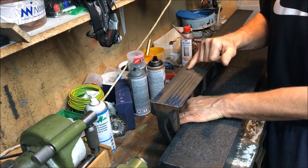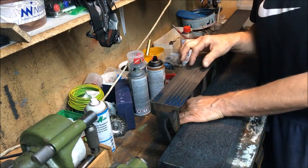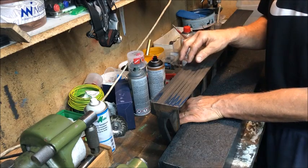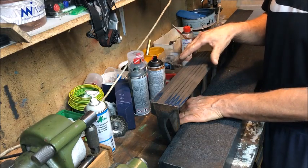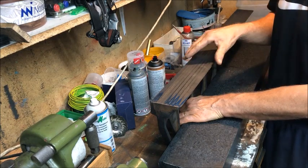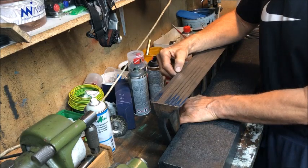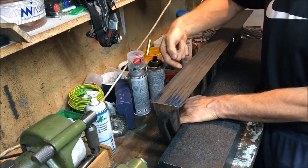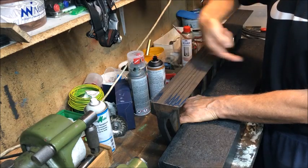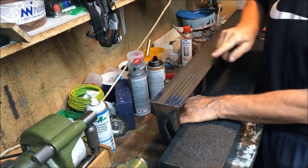The results are based on learning by doing. We initially fed the tool a little bit cautiously, but at the end we took some two millimeter deep cuts with half a millimeter down feed. The downward direction was like this.